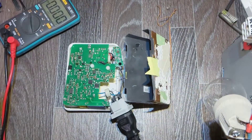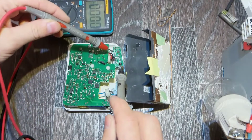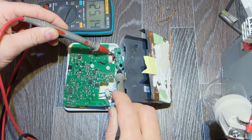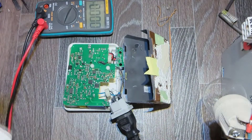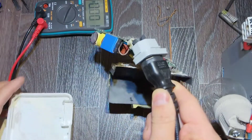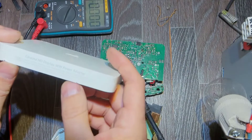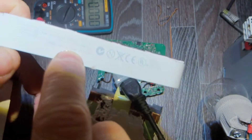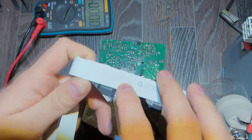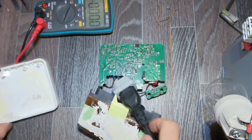I've soldered everything. I turn it on — the lamp blinks and now it is not glowing as before, so the short has gone. As you can see, 25 volts — that's good. I think it is working. Let's see what voltage we've got: it is 24.5 volts under nominal load. When it's not loaded, 25 volts is quite okay. That's definitely a fix.